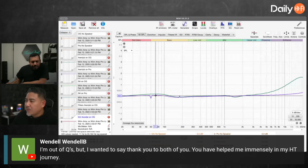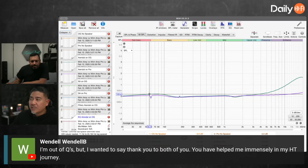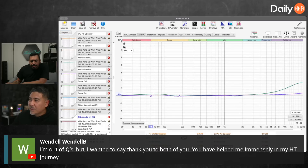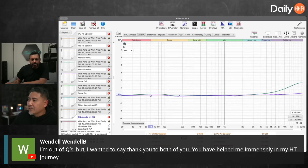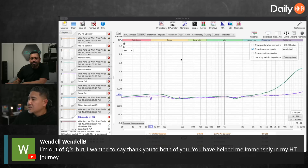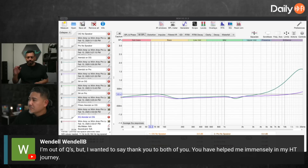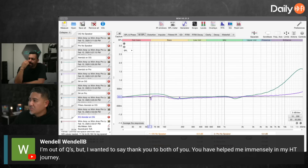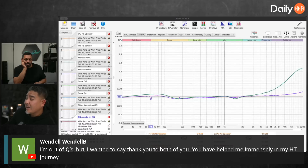What I found interesting is I was measuring some small, narrow dips in the unit with PFFB that the other one did not have. Now again, if I zoom out to the way I normally look at it — and also, if I smooth it using psychoacoustic smoothing — we would probably not really hear that too much, because it's too narrow, a very small area. Versus here, which is a large area. So with psychoacoustic smoothing, those narrow dips are kind of small things you see in a measurement that I'd rather not have, but they're there.